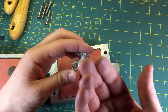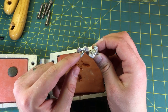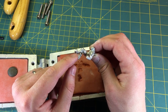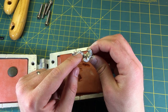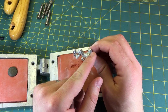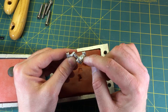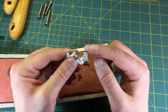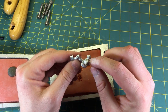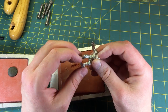So what you have to do - and keep this in mind even if you're doing silicone drop molds or RTV silicone molds - rather than just setting your guy in half and whatever's there gets stuck, you want to create a buildup. You want to imagine a center line going through the figure. For this guy to work, you need the center line to come up along this leg, down here, under and around this arm. Back here you actually want it to go a little bit on the head - if you just go over the shoulder and over the neck, then the head can be trapped up in that top cavity. So you need to let it come up here a little bit and then so on and so forth back down the figure.